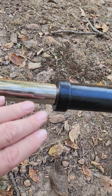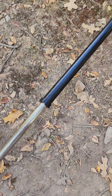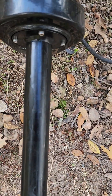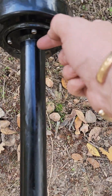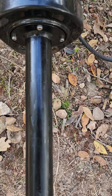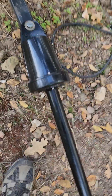I had to take it apart. Thank God the seal wasn't messed up — I was able to save it, get it done right, and re-drive it the correct way with a rubber mallet. What I mean is you hit the other side going down through there — it's a lot like a motorcycle triple tree front shock. Those four bolts hold the sleeve on and the sleeve should be checked to make sure it can move. You can also get access to the threads. The threads should have a lot of grease on them. I put red and tacky grease inside my ram rods — it's good heavy-duty grease that won't bleed out under heat, and it's cheap.